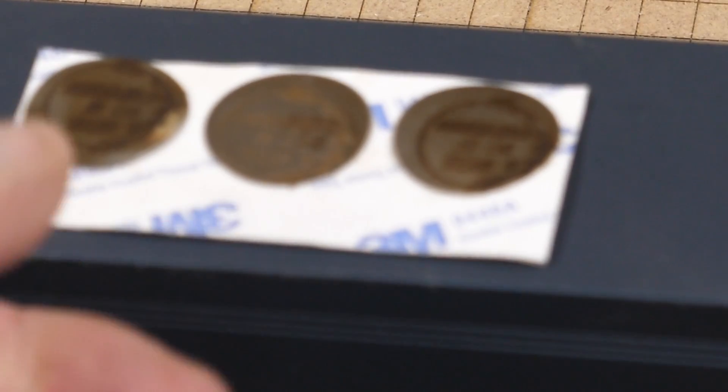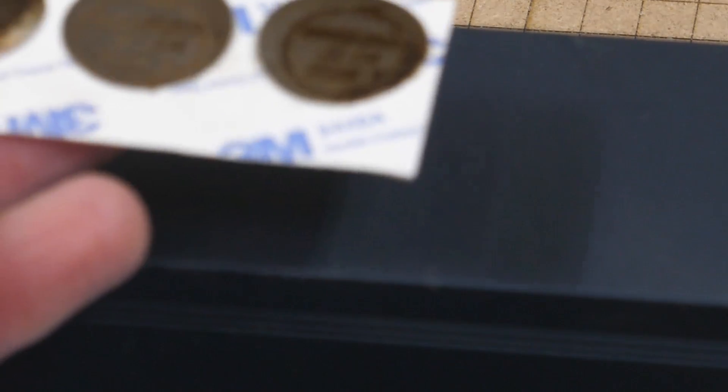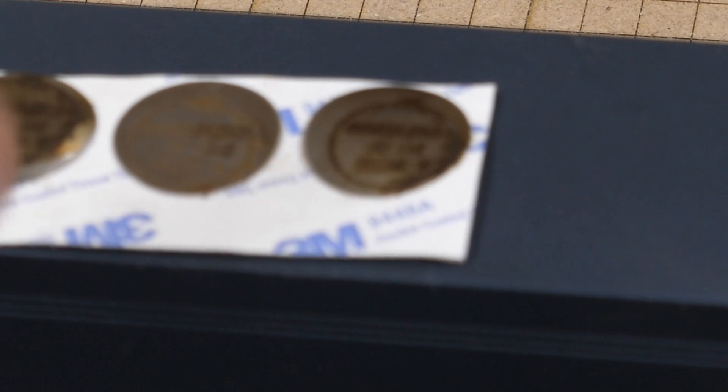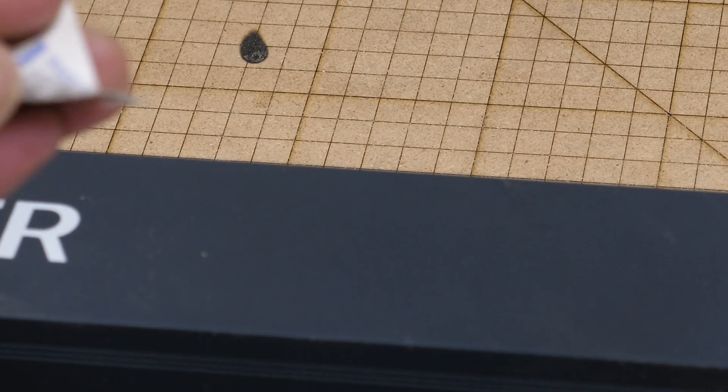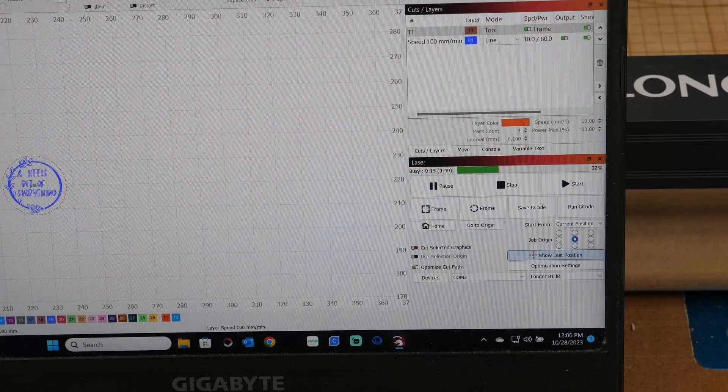Here I've laid up some of the pieces I was doing a trial on when I was still trying to do it with a blue diode laser — hopefully you can see they're horribly warped and completely unusable. With the infrared laser there's absolutely no warping whatsoever. This is a very, very thin stainless steel with an adhesive back. In general, diode lasers are worked with in millimeters per minute, and CO2, infrared, and fiber lasers are worked with in millimeters per second. I'm using 100% power and 10 millimeters per second, which is where I've gotten the best etching so far.